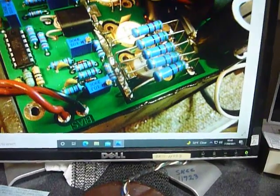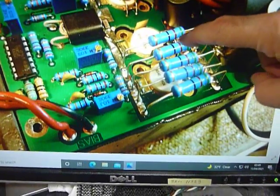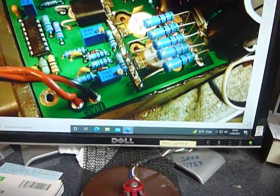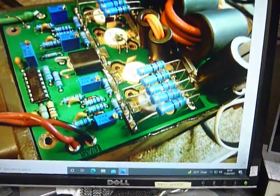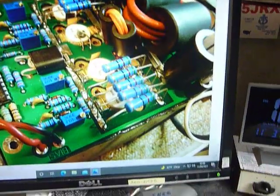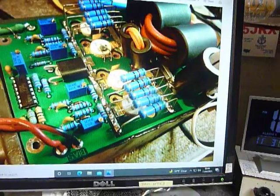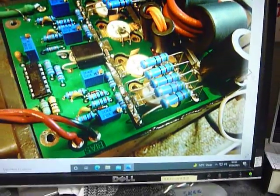They're all laying on top of each other right in here — those don't need to be chip caps, they can be bigger caps soldered right down. That cured the problem with those chip caps popping. This amplifier is very, very rugged. When those caps popped it takes the load off the output transistors, and I thought it might do damage — it did not. I've run the amplifier three or four times without anything connected to it, and also with a short circuit connected when I goofed up. I'm very pleased with these rugged transistors.